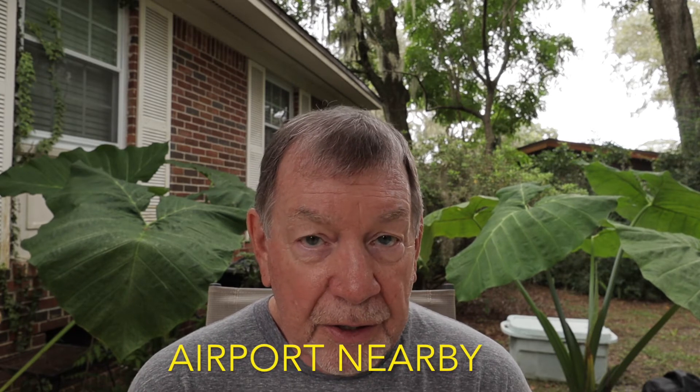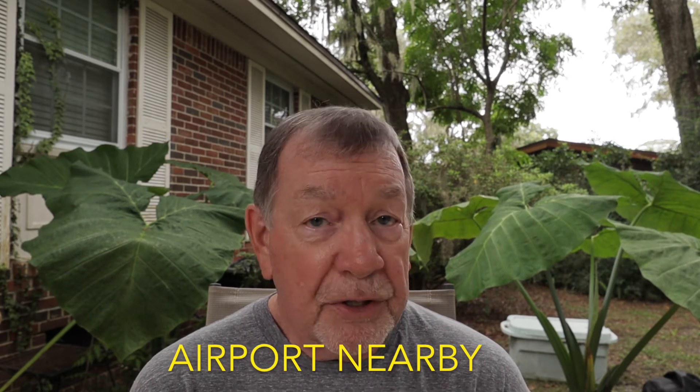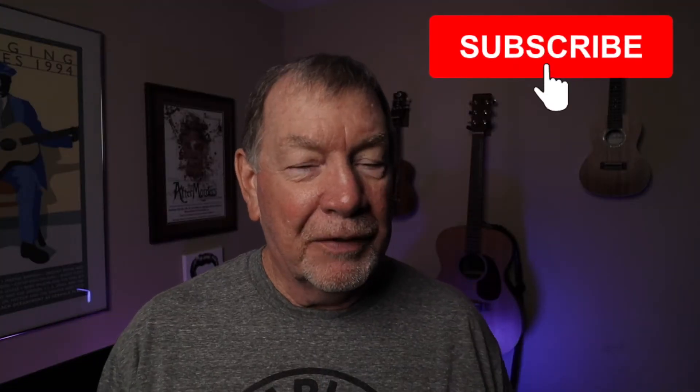Later on I'll show you what those results were. Why would you do this? Well, you may have a camera that's older which has lousy preamps. I have an old Nikon DSLR where the preamps are terrible — I never could get great audio unless I used a digital recorder or some other way of using a different preamp. Another reason is like what I'm doing: you may not be satisfied with the sound from your camera's preamp, and if you just want to take it to another level, this is a good way to do it. So let's take a look and see how we set it up.